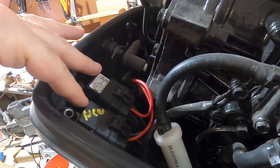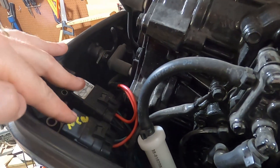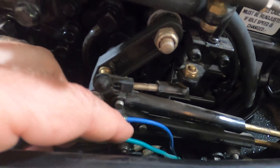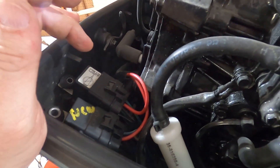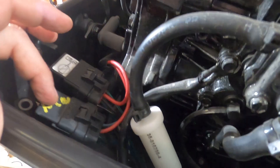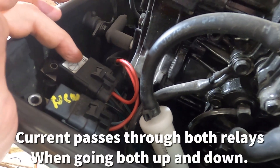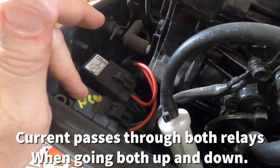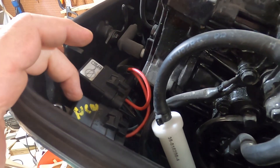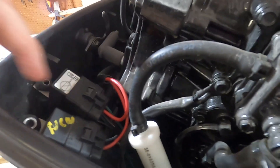Here's what I found out — it was the exact opposite of what I expected, because these relays work like a three-way switch on your house lights, similar to a traveler wire. This is a two-wire system going down to the trim motor. When you energize one relay it sends power to the motor, but alternating between them reverses the polarity, so the motor goes in reverse. Both relays are always in play — when one is energized, the other acts as the return path or ground completing the circuit back to the battery.